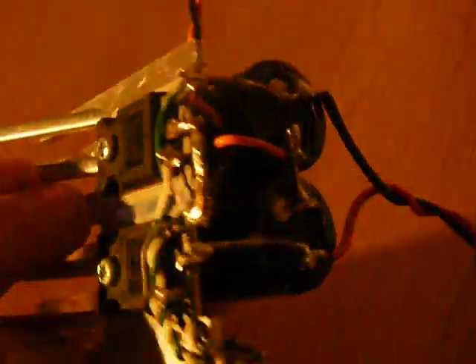This connector goes to the gate drive transformer. I pulled this out of a power supply — all three windings were in parallel. I'm not using the 22-ohm and back-to-back Zener diodes at all; I found this setup to work perfectly. There's the bridge rectifier, and I don't have a smoothing cap — the cap on the half bridge acts as an active filter. I'm powering this with a 24V to 36V supply.